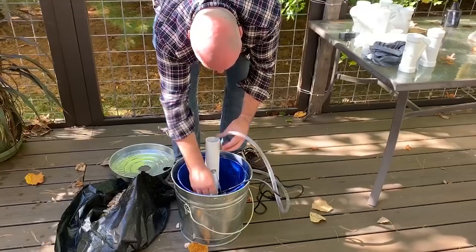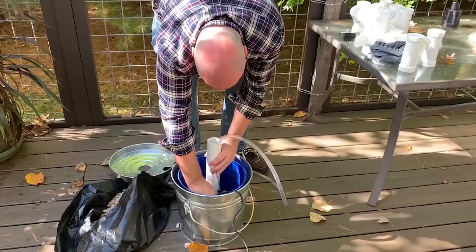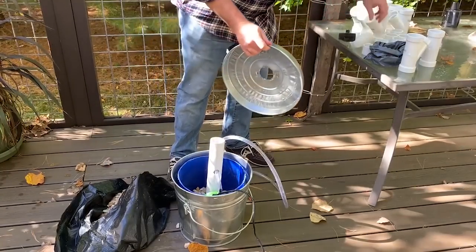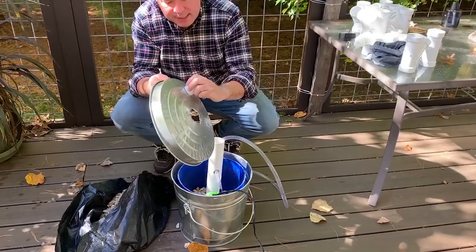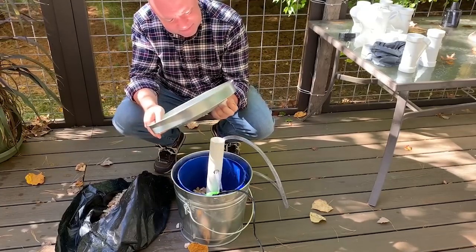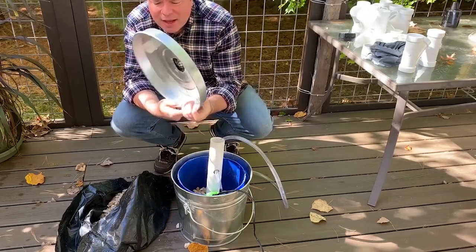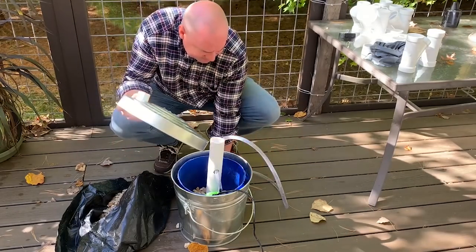That looks good. Now my wire wants to come out this side, which is good because it's all lined up with the hole, and that'll look nice. I'm all about stuff looking nice. Then I have this little PVC pipe, and I'm putting this in this hole because the hole was cut out of metal, and metal is sharp. So I don't want to cut the electric wire. Now later, I might go back and put some caulk around the top just to seal the whole thing up.